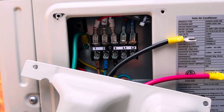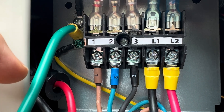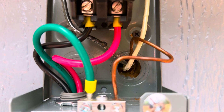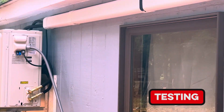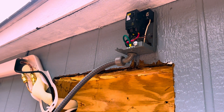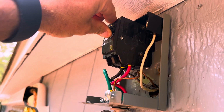If you're going to run AC power to this unit — which you don't have to because it can run off solar — you simply run your ground, your L1 and L2 (both are hot) to the unit. We've got all the connections made. I still need to wrap up a couple of things, but everything is ready, so we're going to flip this switch and we should have power to the unit.